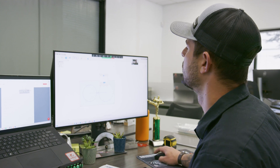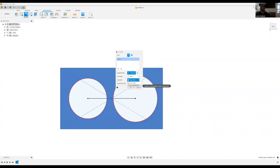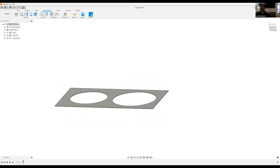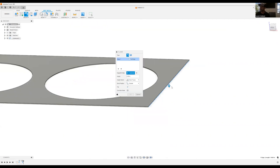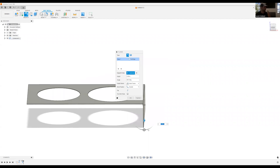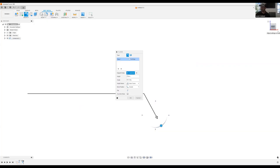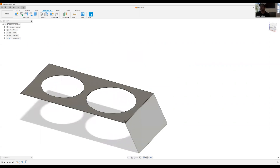Now we can create that first flange — we're going to click on the flange, say new component, and select aluminum 63 thousandths. We now have the top part of our dog bowl. Using the flange callout again, we'll drag this down five inches vertically, but for cosmetic and structural reasons we're going to kick the sides out to 60 degrees. That gives us about four and a half inches, so we'll lengthen it to seven inches overall — it's a big dog.